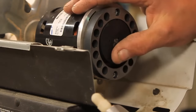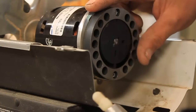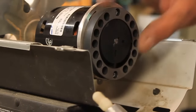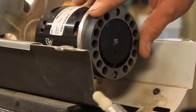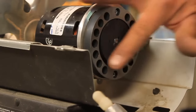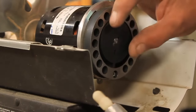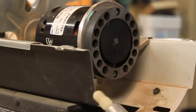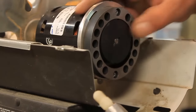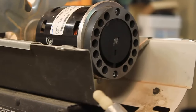These are carbon fiber blades. You don't want to use oil, because if you use oil it will lubricate them but they'll stick from the cold air, and it'll start wearing some of this carbon fiber off and just get all gummy and they won't operate properly. So we're going to use graphite. We're going to clean it off real good with some brake cleaner and lube it up with graphite.